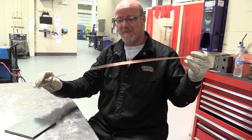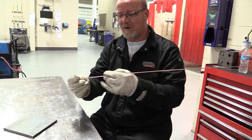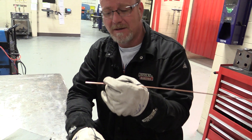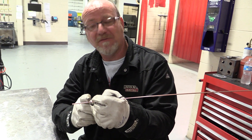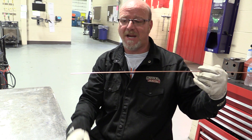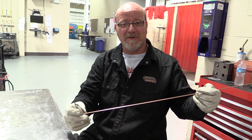First things first — these filler metal rods are flimsy and they're long. You can cut them in half to make them a little more manageable. But the problem with TIG welding is you're feeding this by hand. You can hold it up close and have really good control dipping it in your metal, but then you dip it about five times and you're burning your hand. Or you can slide your hand back and try to do precision dips on this flimsy rod and it just doesn't work very well.